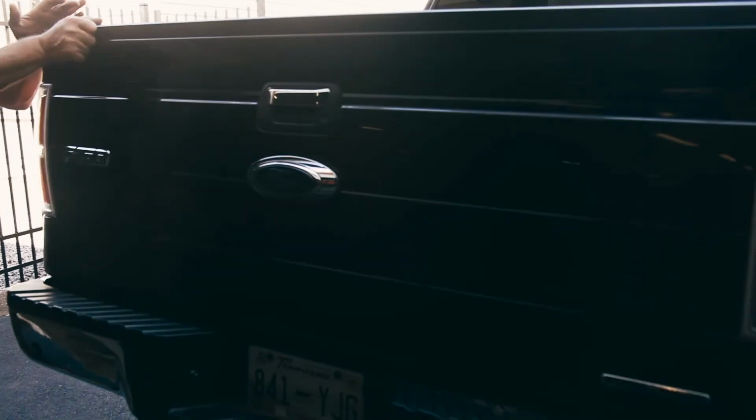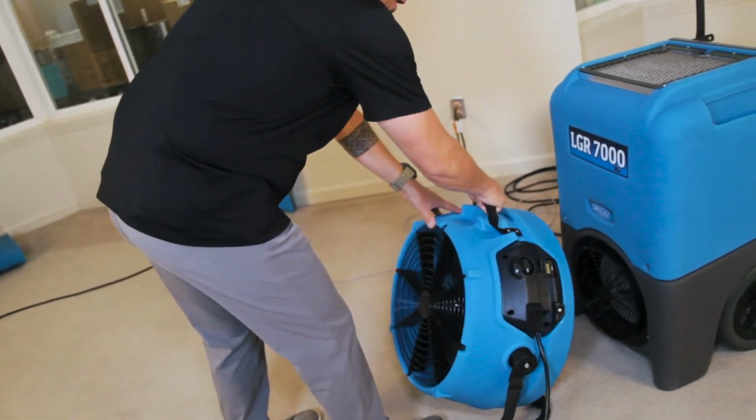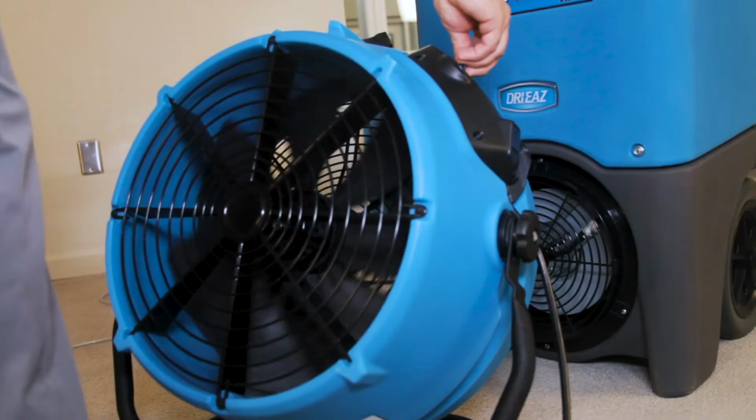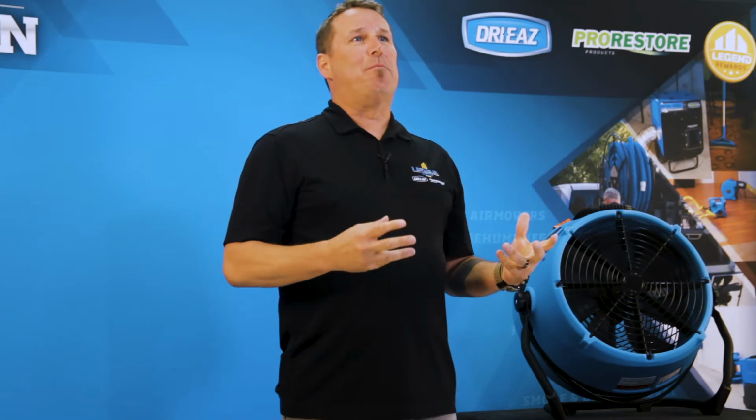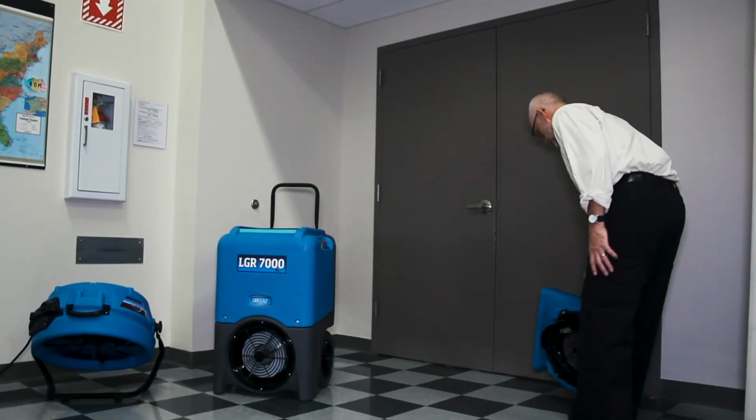To accelerate drying, especially after a leak or flood, direct the warm, dry air from a Dri-Eaz dehumidifier into the Stealth. The air movement promotes evaporation of the water from wet materials and circulates it into the air so the dehumidifier can effectively remove the moisture. This is a basic drying principle. Air movers and dehumidifiers work together for the most efficient moisture control.